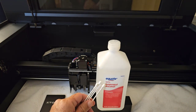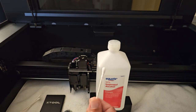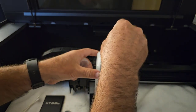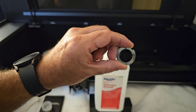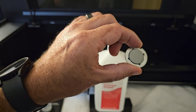Here's what you're going to need: the highest percentage isopropyl alcohol you can find. This is 91%. I would not use the 70% because that's 30% water, and the water is going to allow residue to settle back on your mirrors and give you water spots. And we have some regular Q-tips — nothing fancy. Just dip the Q-tip in the alcohol and clean off the mirror. You'll see it dries really quickly and all of that smoke residue will be gone.